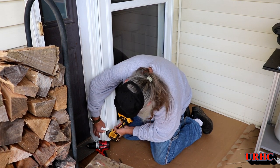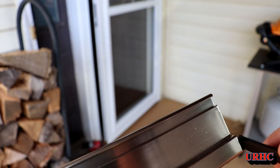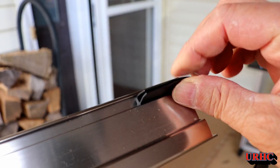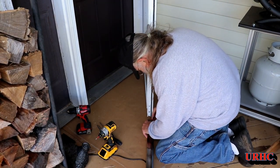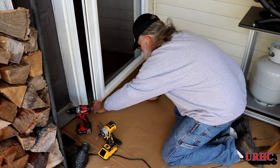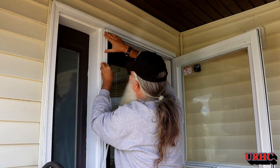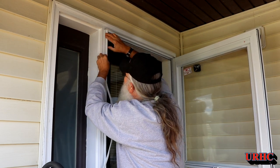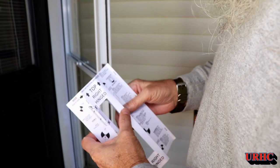Then just go down the whole side and make sure the gap's even and everything closes right. Then there's a bottom adjustable seal piece, and they give you a rubber seal that has to slip in there. It turned out it was too cold — I had to put it inside for a while to warm up before I could get it in place. Then you've got to go back and clip it on over the door — you can see how it clips in there — and line that up on the bottom. There are two screws that go on the inside, and then some plastic strips that snap in up both sides and across the top to cover the screws that went in on the face.